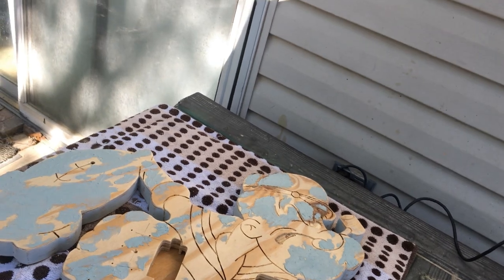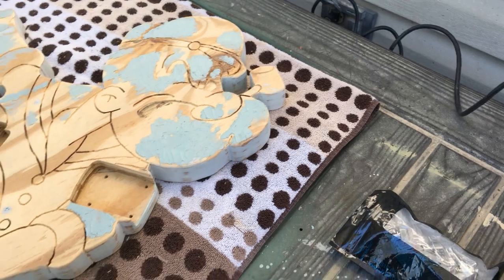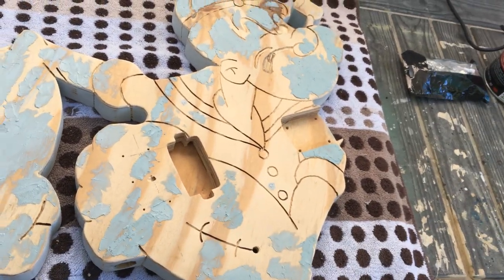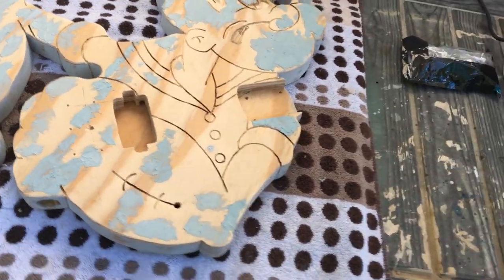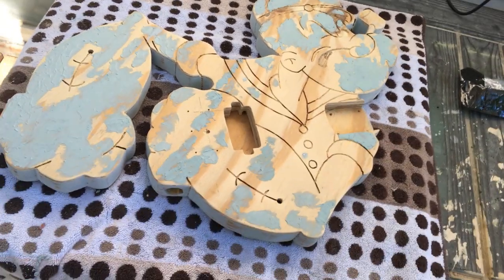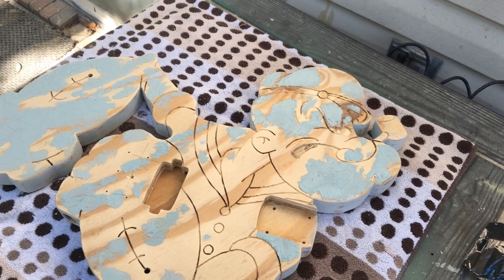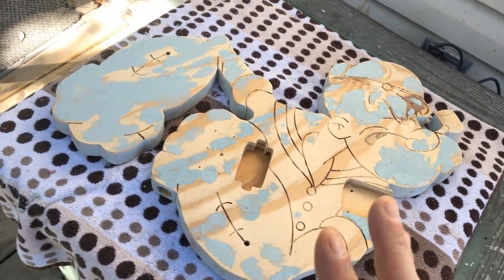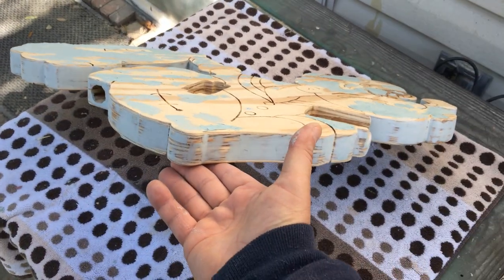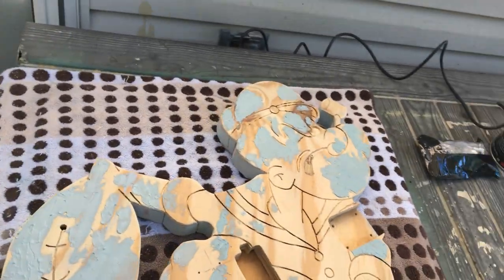All right, quick update. I got all the sanding done on the sides, and it looks pretty awesome. Then I applied body filler to the front and the back, and I'm letting it cure. It's kind of overkill, but any little surface imperfections, I try to fill with body filler. That way, when the next step comes, the wood grain filler, it'll have to fill in less, it'll sand smoother, and it'll look better in the end, from what I've learned doing this technique and perfecting this method.